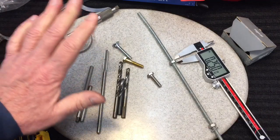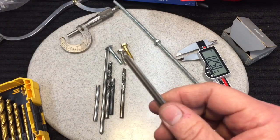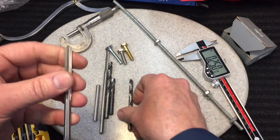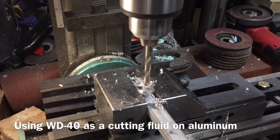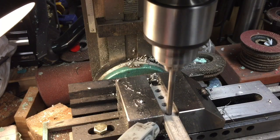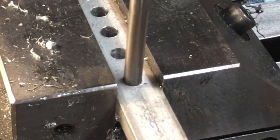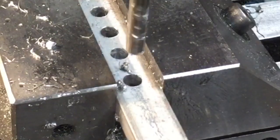Never go by the shaft measurement. So if you want to make an exact quarter-inch hole, you have to drill it a little bit smaller and then take the last few thousandths off with a reamer. I'm going to film this reaming operation in real time. It's very important that you always lubricate the reamer — it needs a lot of lubrication. Also slow the speed down; going too fast creates heat which may change the diameter. Go nice and slow, with a lot of lubrication, and go back and forth to clear the chips.